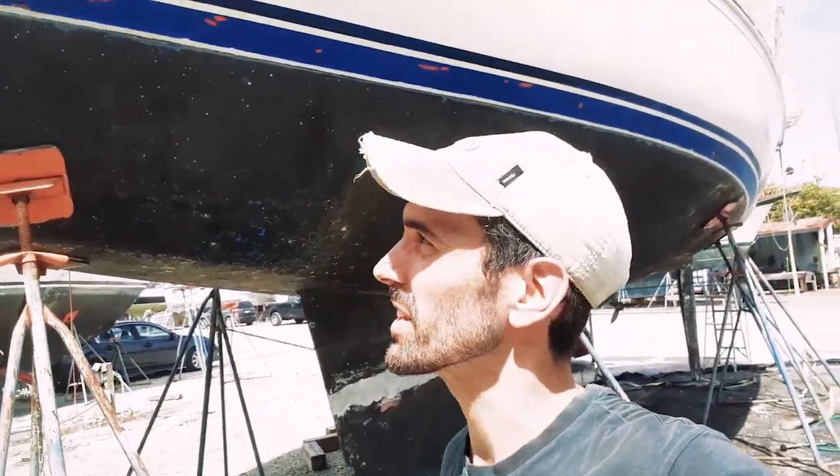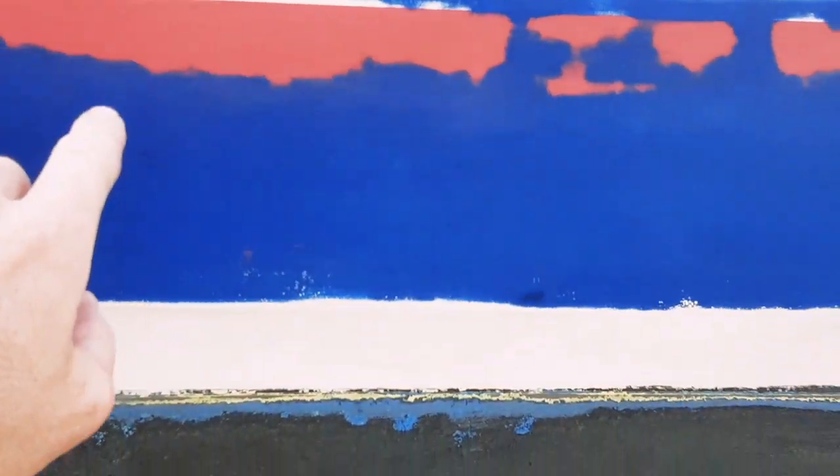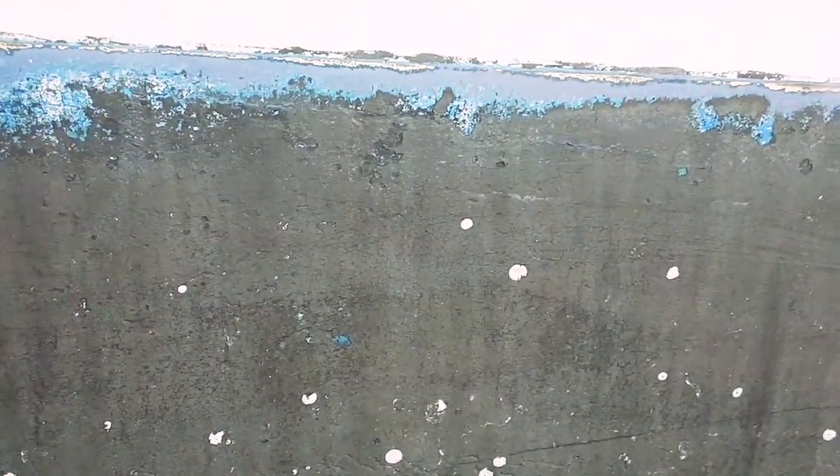So now I've completely finished sanding the stripes and the waterline and getting ready to apply barrier coat so I can increase the waterline with antifoul. There are some spots here where you can see some red showing through — the previous coat of paint or gel coat on the boat was red back once upon a time. This is going to be bottom. I'm going to increase the barrier coat here then antifoul paint all the way up to that line, and that way we should have an easier time cleaning the hull when she's in the water.